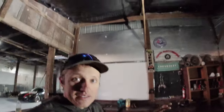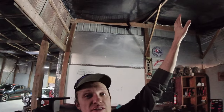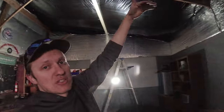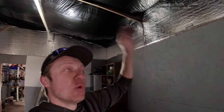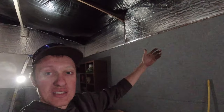I did not staple it down the center line between the two trusses — the trusses are just a 2x12 and a 2x12. I stapled it along each edge, and what that does is any moisture that accumulates between the metal and that plastic gets caught in the plastic. As the plastic runs down to the wall, the wall insulation holds the plastic up, so the moisture will run down behind the wall insulation — effectively between the steel and my wall insulation — and that keeps the moisture out of the building.